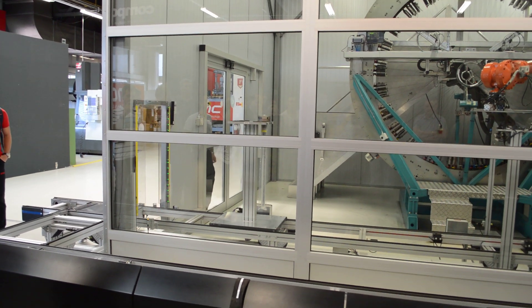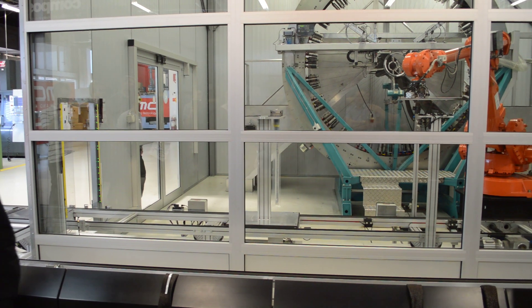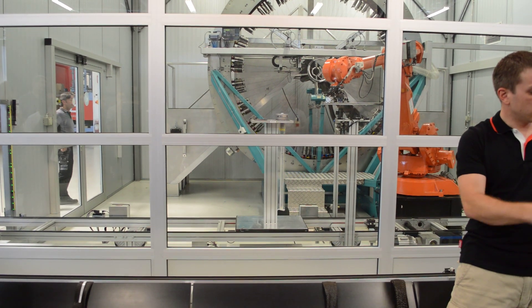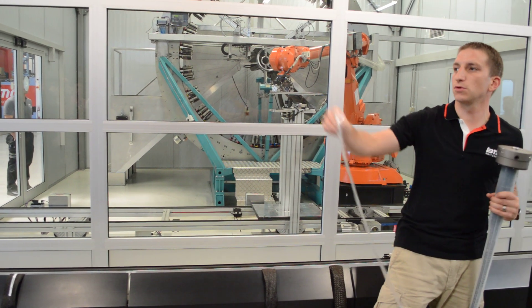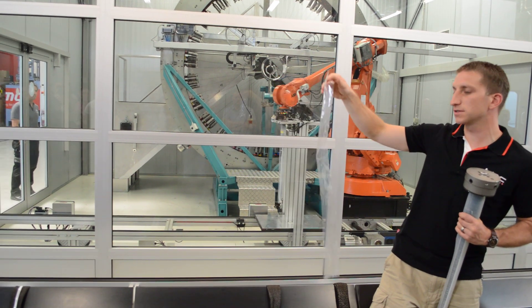We have a very thin plastic sleeve on top of the mandrel. This is just a separation layer in order to deform or pull the mandrel easier out of the mold. This one is separated from the tube after, so it doesn't stay inside.